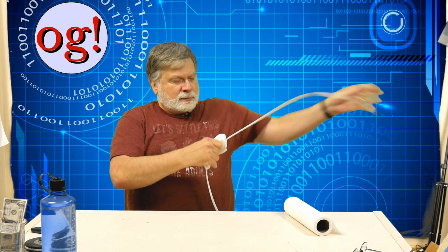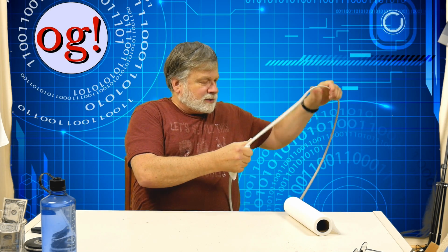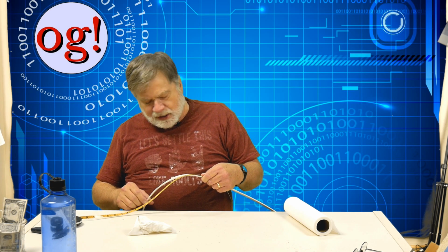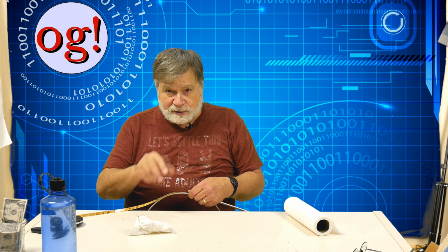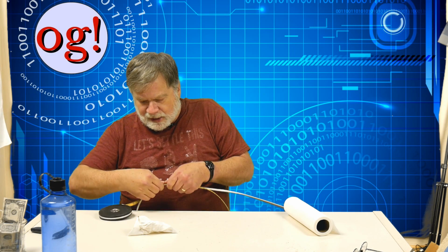So let's take this one that I've got right here. I'm going to first just clean it off a little bit, just so we don't get gunk all over. Now this wire is what's often called Romex, and this happens to be what's called 14-2. So there's two 14 gauge wires in here, one white, one black, and there is a third wire that's a bare copper wire for ground. So there's actually 3 wires in here, so whatever length we get, we triple. 19 feet and about 2 inches. So that means we're going to have 3 pieces of wire 19 feet long.